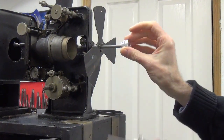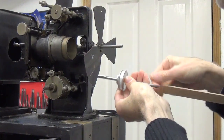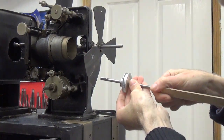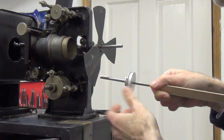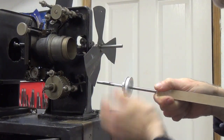This small pulley — one turn of that will turn this large pulley half a turn. So for each frame of film, the colour wheel will turn half a turn. In other words, the green section or the red section only will turn, so the next frame will get the green section or the red section.